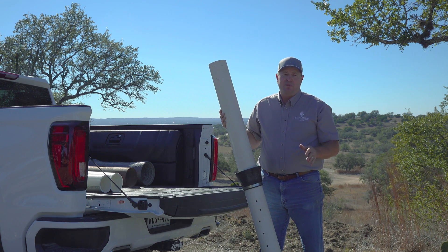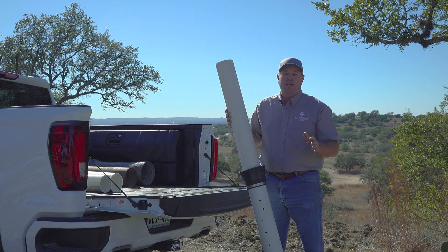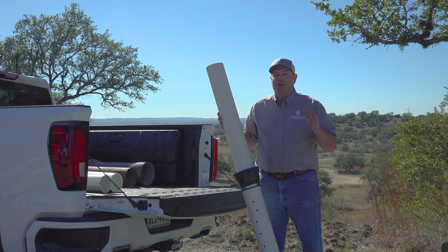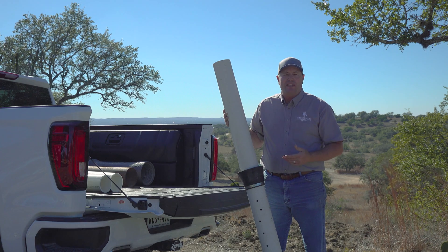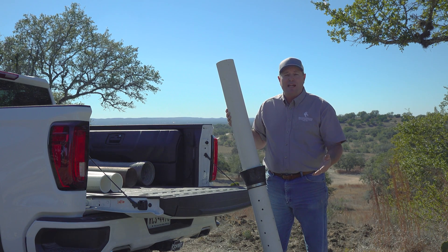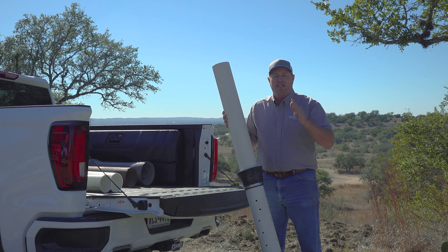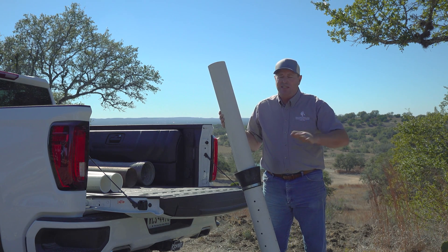Below the packer we have three main options: open hole completion, perforated casing, and manufactured screen. The open hole completion is exactly what it sounds like — there is no pipe below the bottom packer. Being open like that is certainly cheaper because you don't have any pipe to buy, and it's easier to clean out. If you get sediment built up in the bottom of the well, we can go in and jet that out. The downside is that you might have problems with more sediment coming in, or you might have rocks fall in and trap your pump, or your pump might get stuck below the bottom of this pipe and you might not be able to get it back out. Open hole completion is certainly an old way that we used to do things, and we don't do it that much anymore.